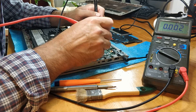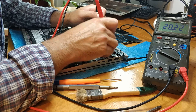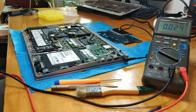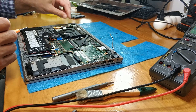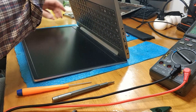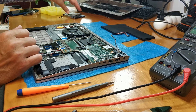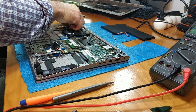Yes, we have voltage on the jack here. So we have to take out the main board — I think the first MOSFETs are beneath the main board. The BIOS battery is here, so let's take out the BIOS battery and press the power button. Now let's wait, then put back the memory.